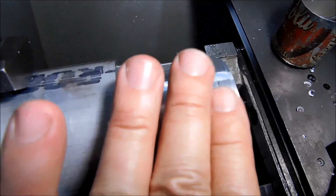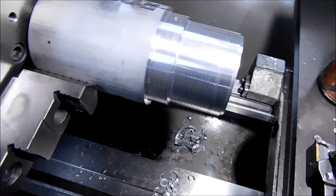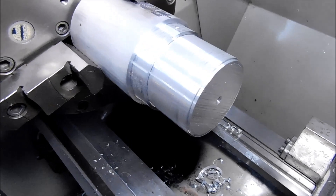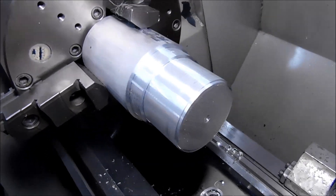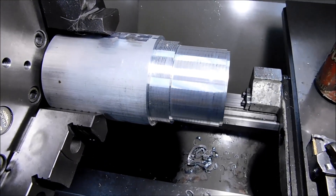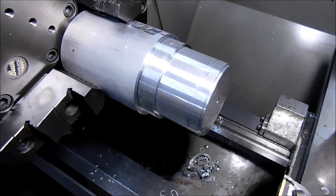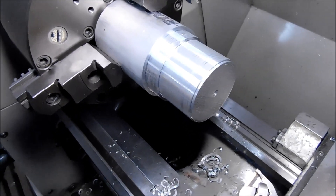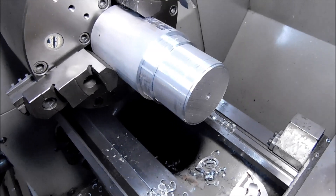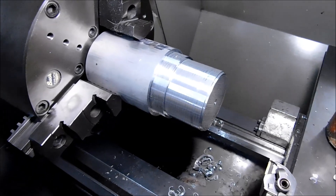The finish isn't bad either. It's still very warm to the touch, but we could make this entire end of this piece go away in just a couple of minutes. C's and 6's are what you're looking for. If it's too long, back off on the depth a little bit — it worked out very well. And if it still won't break, push it a little bit harder. Don't be afraid of it — these are machines and they're a little tougher than we are.